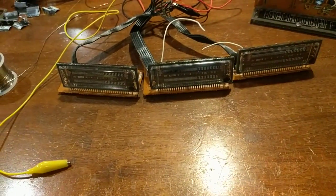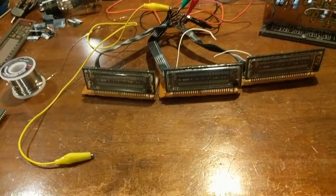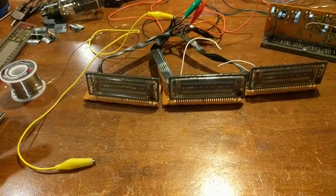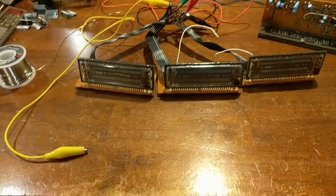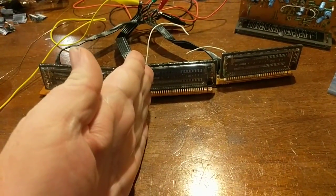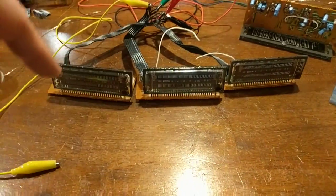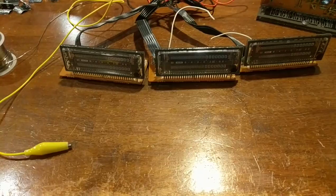And the way the shutdown is going to work is I'll have a high side load switch, which I'll go through all these parts in a minute. I'll have a high side load switch to switch off the load to the Raspberry Pi, and I'll program the Raspberry Pi's device tree overlay so when the Raspberry Pi goes into standby or shutdown, it toggles a GPIO pin. That GPIO pin will go off to the load switch and it'll cut off the power supply.